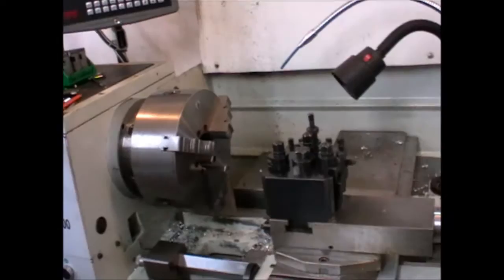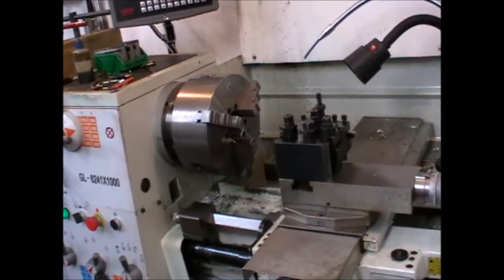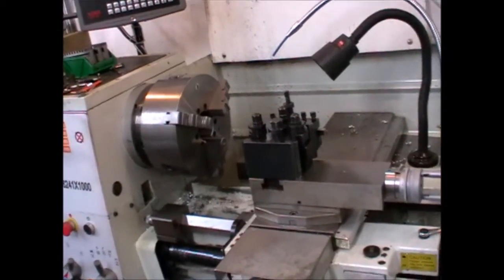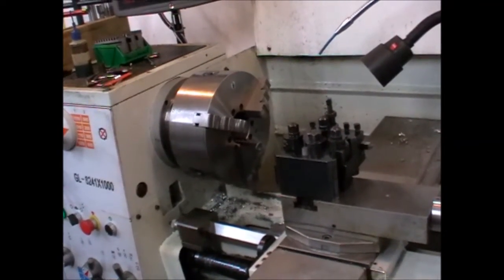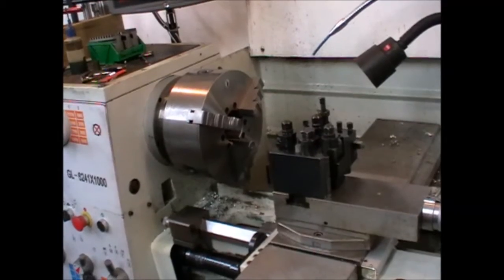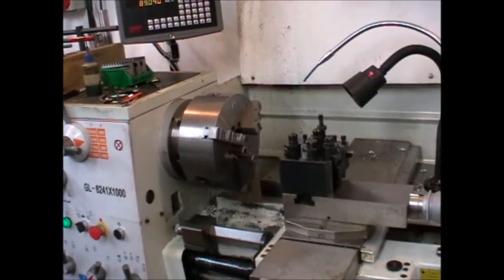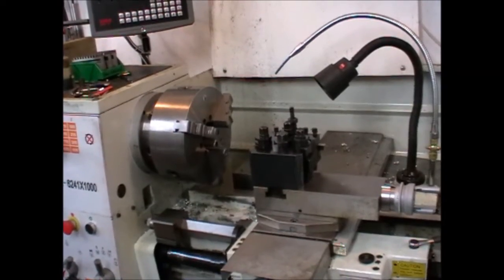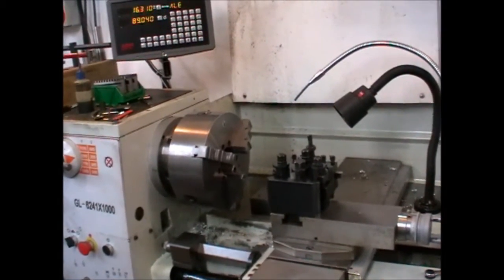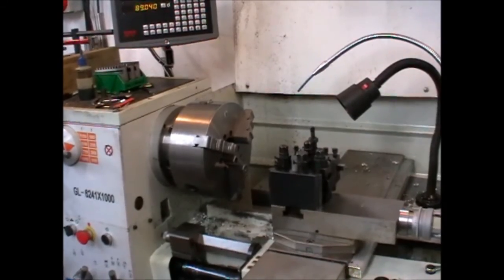Now that may be a bit contentious and cause a few arguments, and I'd be keen to hear from people on that subject. If you do production machining on both a manual lathe with tool allocation DRO and a quick change tool post, and CNC turning — if you do both and you have an argument, please place it. But a lot of people are only familiar with one technology and can't really argue objectively. So my thoughts are: for simple parts where you only want one or two, a manual lathe is the quicker way to go. For multiple parts — 10, 20 or more — CNC is just streets ahead. You can set the machine up to make parts while you're doing other things, and it's just so much more fun than a tedious boring run all day long on a manual lathe.